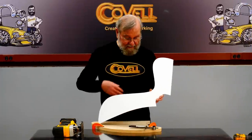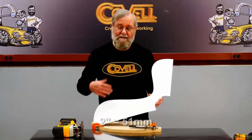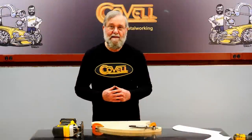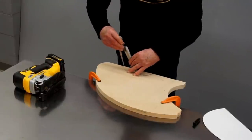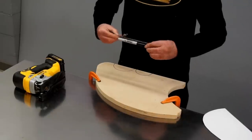Here's my full-size pattern. Now I can lay this on a piece of 18-gauge steel, mark around the edge, and trim the part out. I want the bends on the edges of the seat sides to have a taper — an inch and a half radius at the back and two inches at the front. So I need to make a special fixture: I'm going to put half discs on a board and bend the metal around that. I'll make marks for the 4-inch diameter circles using a felt-tip marker on a pair of dividers.